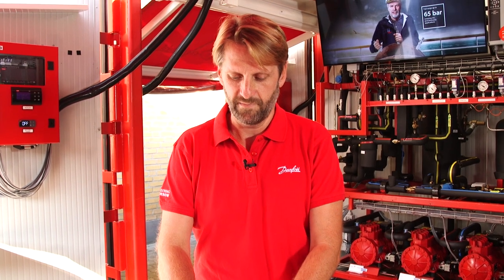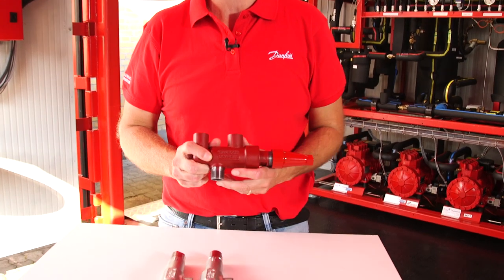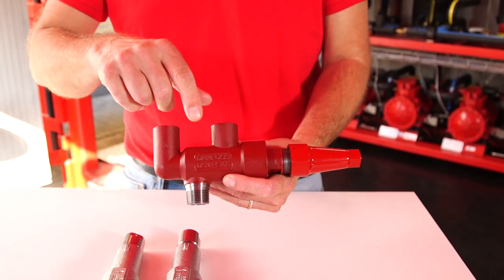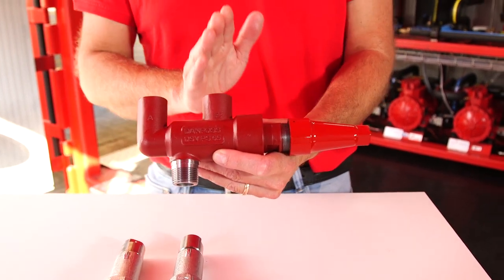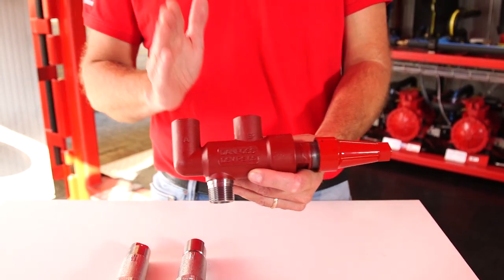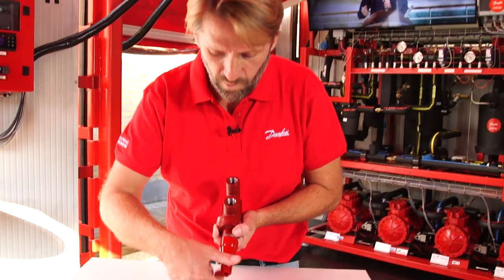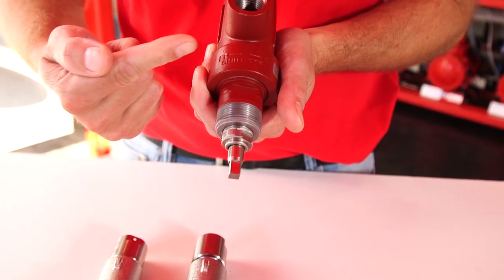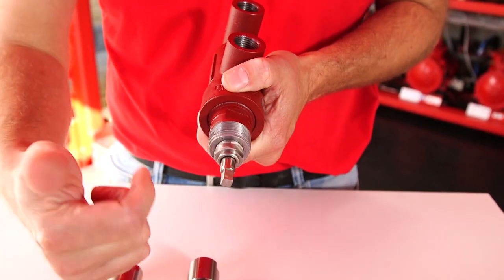To make that safe, as required in EN 378, we are also introducing the DSV changeover valve, where you can mount two SFAs and switch the port — closing one and opening another — ensuring that you always have one safety valve in operation while you service or replace the other. To make that even safer, we have also ensured that you know in which direction to turn the spindle: to open or shut port B, you turn it clockwise, and opposite to reverse.